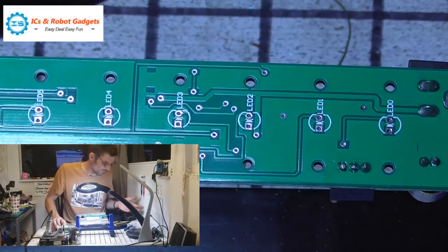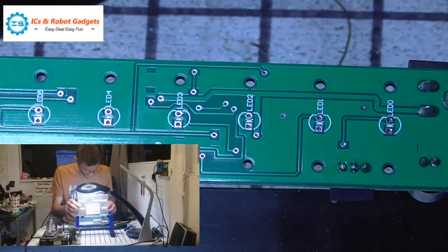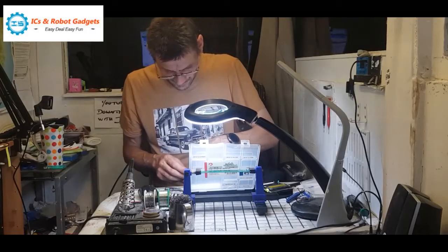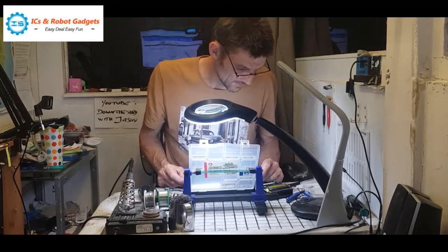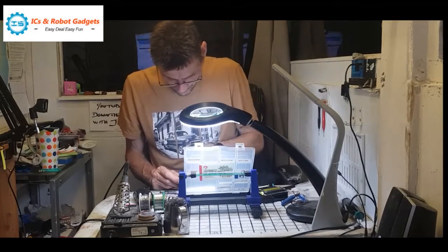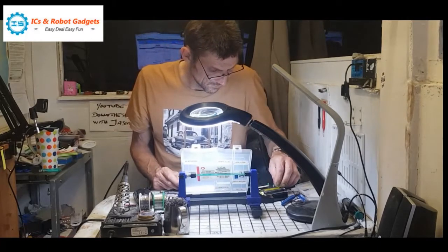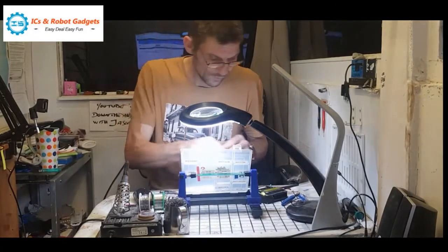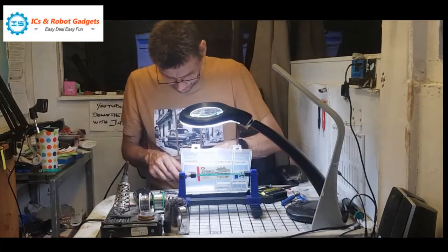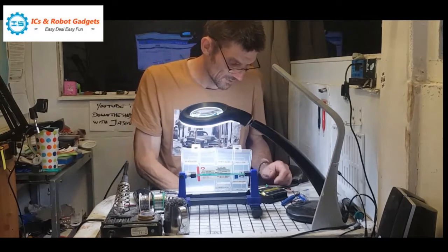So, we have no greens. Forgotten what this one is now. Red. Clear red. So what I'm going to do is, because I can't remember what we called the full colour ones, condensed or whatever. That's a 2.23. Didn't like the flash on that one. That's better. That's a 1.98 volt, so that's acceptable. So we'll have that one. Decent flash on it, 1.99 volts. So we'll have those two.